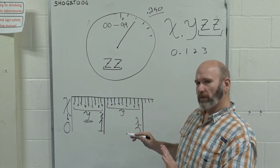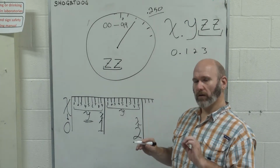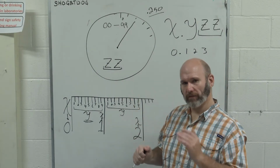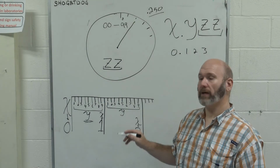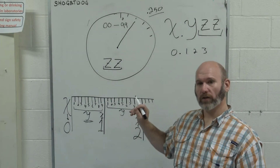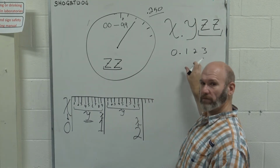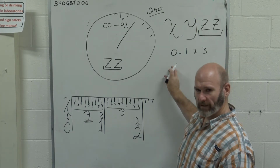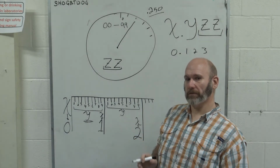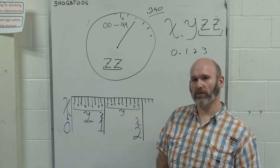I really, really want to urge you, when you first start measuring things with dial calipers, to actually physically write the number down and consciously write it in 3 decimal places, and start from the dial, writing the last 2 of the 3 decimal places down, work your way back to the 100 thousandths place, and then finally writing down your inch value. That will help you to solve many of the problems that you will face.